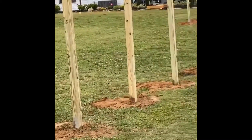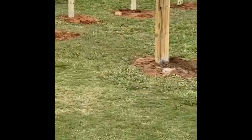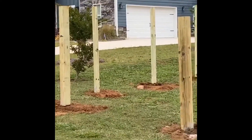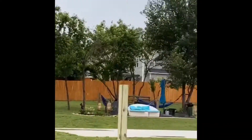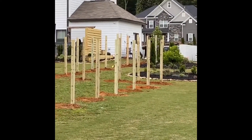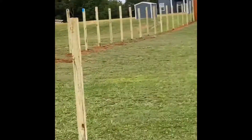It'll look a lot better tomorrow — you guys will see the finished product. I'm doing a double gate right here. You can see those six-by-six posts. On the double gate, I'll be using the G-Force hinges. They're a better quality hinge with a lifetime warranty. They come from Florida. I prefer those over the home depot hinges — they work fine for a single gate, but for a double gate, if I can get my clients to purchase them and we have enough time — I usually have to wait two to four days to get them — I use the G-Force hinge. It's a much better hinge. So this is what we got: 381 feet, horizontal.